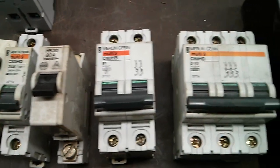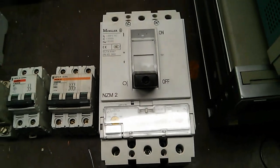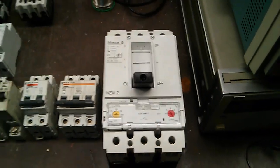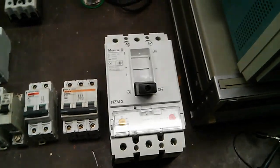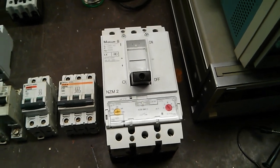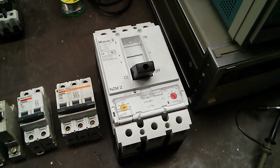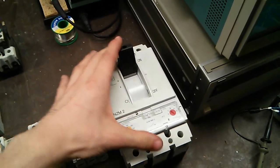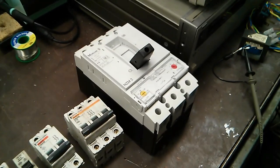All of those MCBs — single pole, double pole, triple pole — and then we get the big distribution type fuses. This one is a Muller MZM2, that's a 200 amp fuse. That's a pretty big one compared to the rest of them. That was actually given to me by a wholesaler as they were throwing them out — they'd exceeded their shelf life apparently, so it's practically mint condition, brand new in the box, but just exceeded about a one year shelf life. When it operates it's pretty loud — forgot to mention to watch your ears on that.